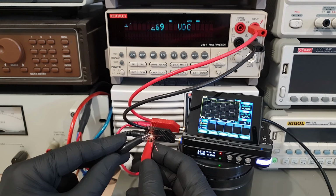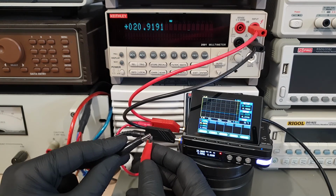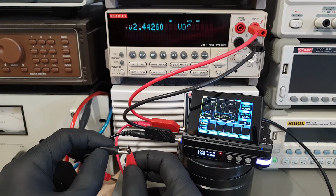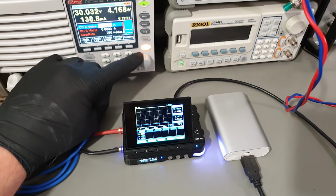Well, boost converter outputs are usually not that clean, especially when you squeeze them into such a cute little pocket-sized enclosure, with no space for large smoothing caps. I wouldn't be surprised if there was a conflict with their specified world-class ripple figure. I wouldn't mind if there was.